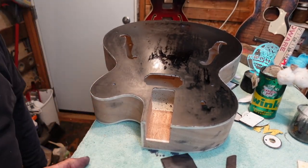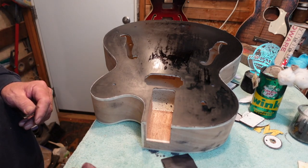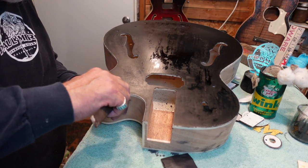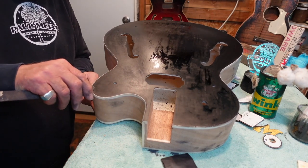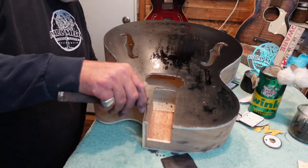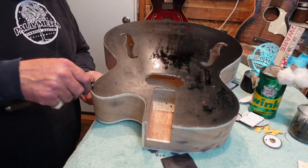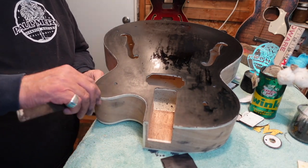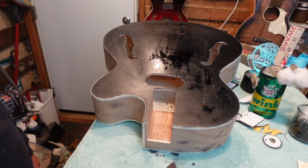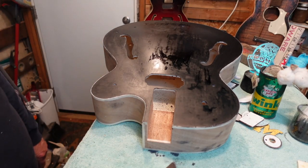All right, guys, look at that. What a mess, huh? What a beautiful mess. Now, tricky part of this is I can take my scraper that I made out of a band from a 48-inch tree box, and I can walk around like this to this binding, and that white binding, I'll bring it down to level, and it will pop against this dark black oak gall ink. There we go. Gotta do the bottom and the sides, and I'll catch up with you then.